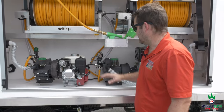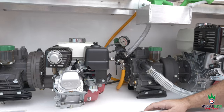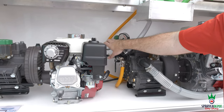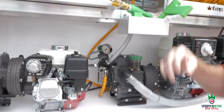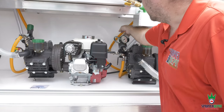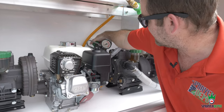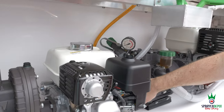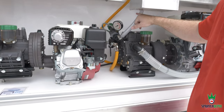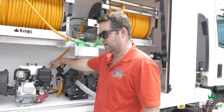What I want you to look at is the adjustment lever. Right now this is in bypass mode. When your guys go out for the day, before they start spraying it should be like this, and when they come back it should be like this too — bypass mode means no pressure is trapped. It's just flowing through this line back into the top of the tank. When you want to spray, put it in pressure mode and use the knob on top: screw it in for more pressure, back it off for less. Whatever doesn't exit through the pressure lines automatically goes through the bypass line.